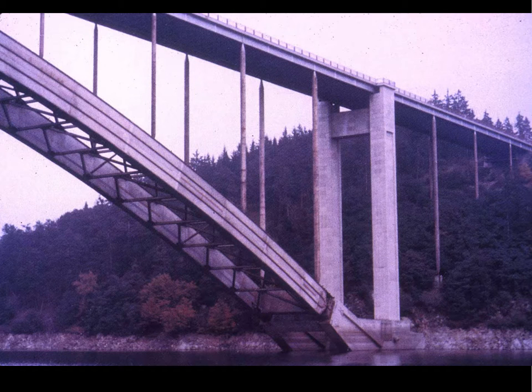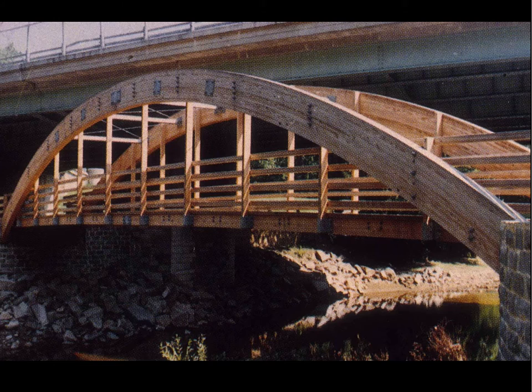The arch can be designed to be stiff enough to resist roll-through buckling; in this case the stiffness comes from the beam-like thickness of the arch — it has simply been made thick enough to avoid the buckling process. This is a similar concept executed in wood: we see a very deep glulam arch, which is effectively resistant to roll-through by virtue of its beam-like qualities.